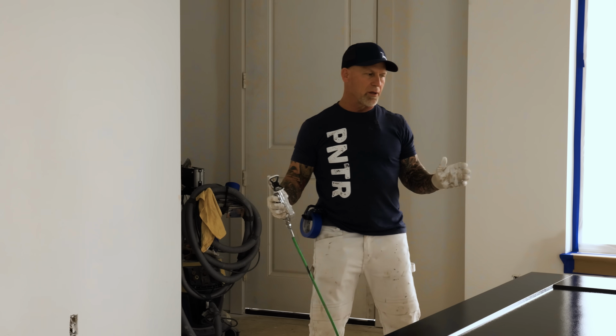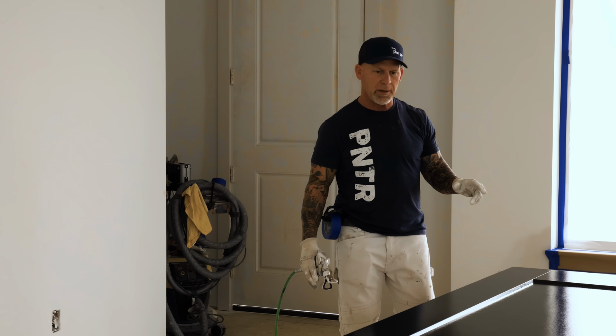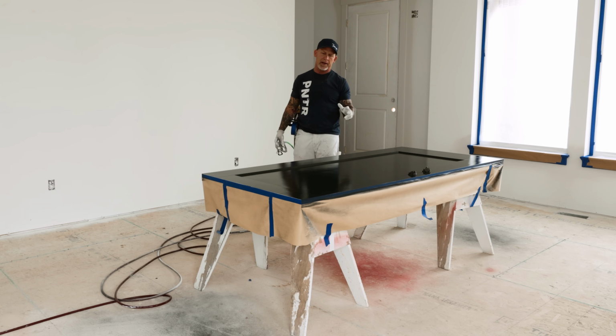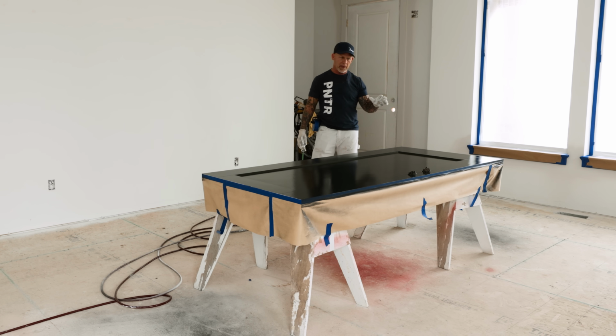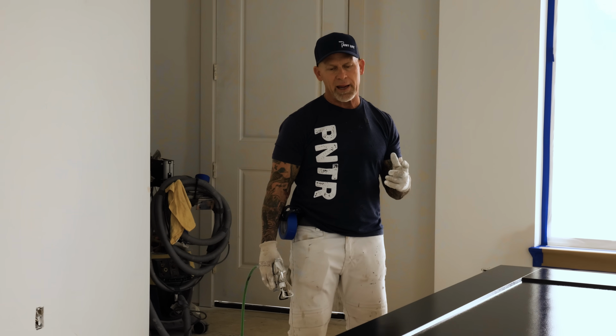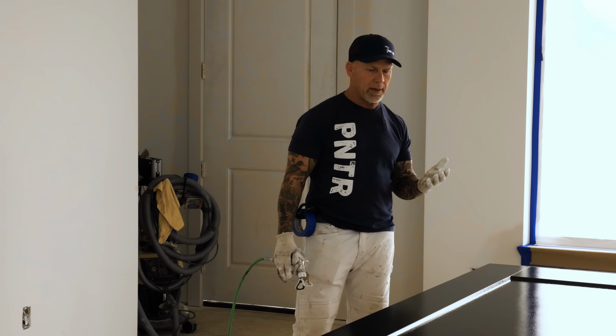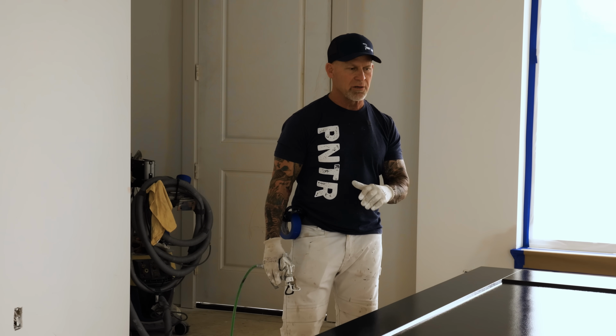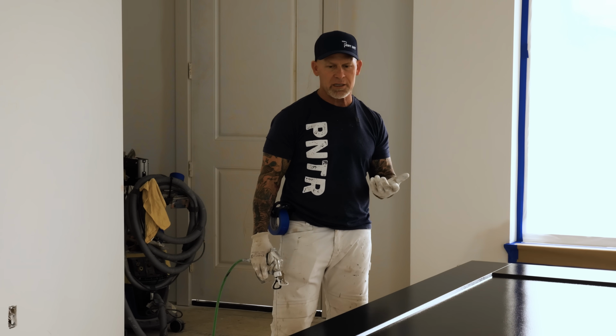One thing, this is exterior paint. Some people are gonna look at it and say it's eggshelly. When you paint them, exterior paints look really eggshelly, and then they begin to dry out over time and level out. Exterior paints don't give you a glass-like finish like interior enamels do. They act differently, they spray differently.